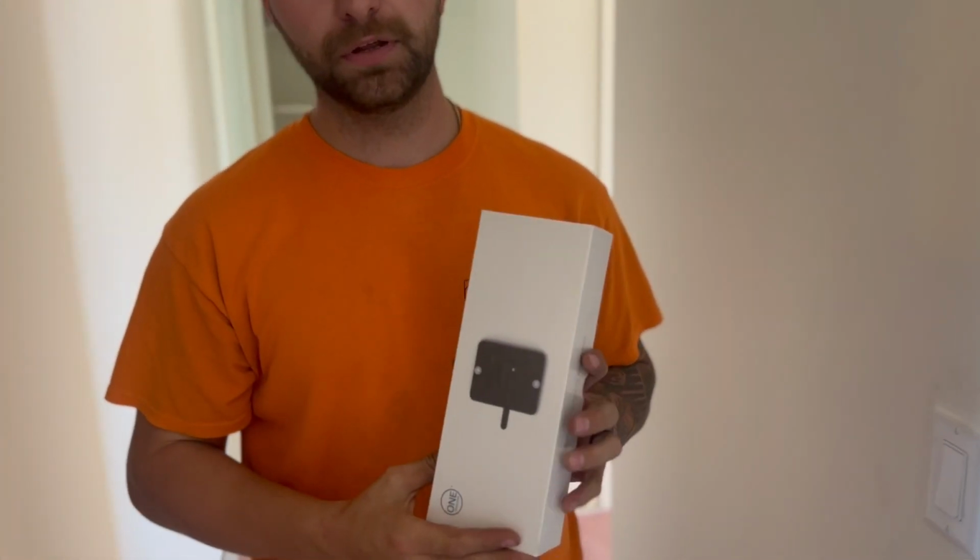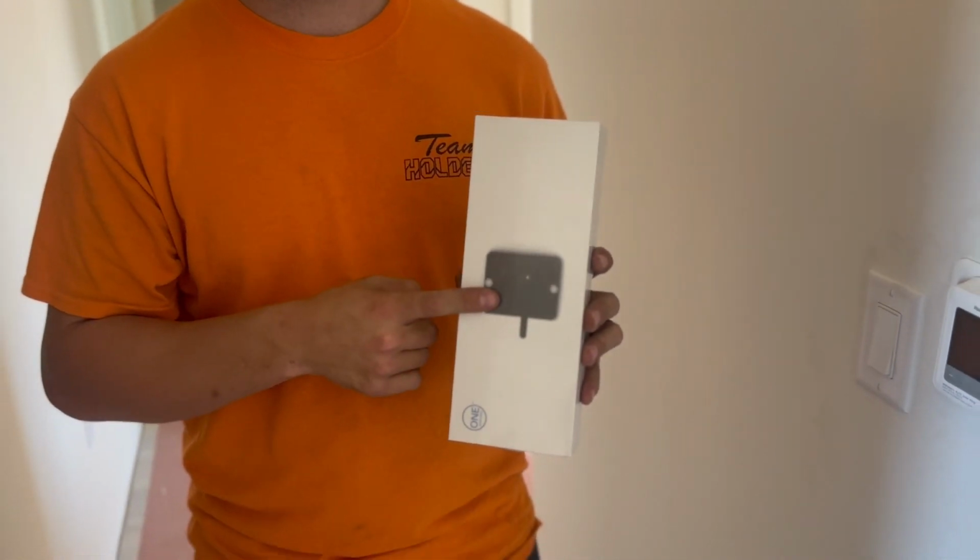And this thermostat is also connected to the Daikin Cloud, right? And that's an optional service that you can get where it actually monitors air quality, right? Yes, so it'll monitor your air quality, which this device here will be installed in the attic as well inside the unit. As the air is passing through this monitoring device, it'll monitor the air quality of the home. And if it gets bad, it'll notify the cloud, which notifies your thermostat, which will notify your phone, saying, hey, your air quality is poor. It's either time to change your filter, or it also will tell the air purification device to kick on and start doing its thing. And also, this monitor here can tell you if your airflow is not correct and some other things that most units can't do.